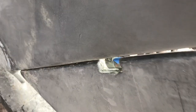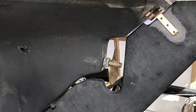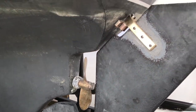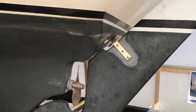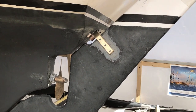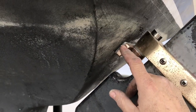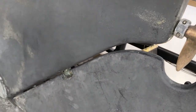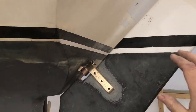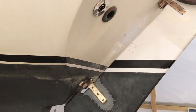That was relatively simple. I did remember to tape in the nylon washer so it wouldn't fall out. Now I'll attach the transom gudgeon - I'll do the middle one first. I've now got it dry fitted and this did take quite a bit of work to get it fitted properly. When you're adding more than two gudgeons, you need to make sure that the third one is in the same axis as the first two. In this case I ended up having to use a little bit of a shim made of G10 as well as two nylon washers. The rudder is working nicely - I just need to over-drill up there to protect the wood core and then seal it for leaks.